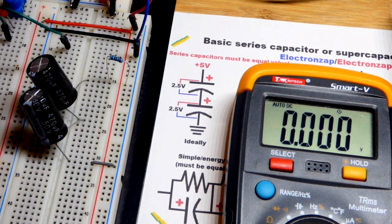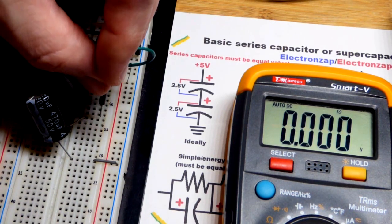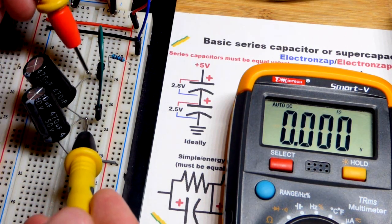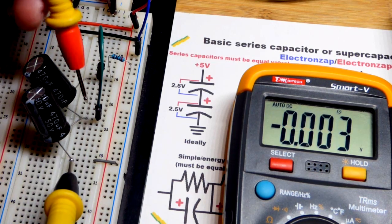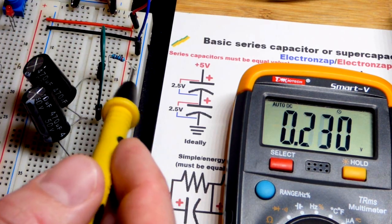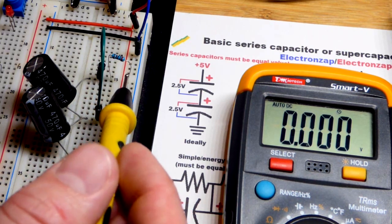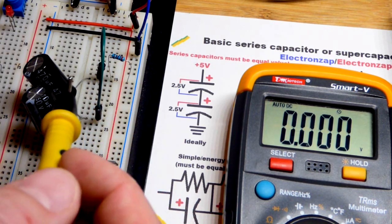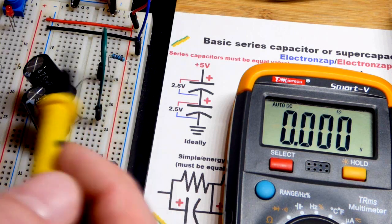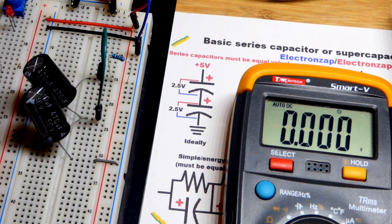Worst case scenario, since we're dealing with low currents and low voltages here, I can short circuit that capacitor right there. With the short circuit, it suddenly went to zero volts. And then of course this one has built up that five volt difference. I do have a current limiting resistor, so it slowed things down a little bit — this didn't instantly charge. If we were directly connected to the rail, it would instantly charge, and this one would have instantly discharged with the jumper. But we have some current going through that resistor, then it bypasses this capacitor going to that one, charging it up to the five volt rail.